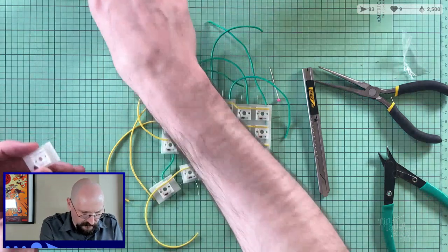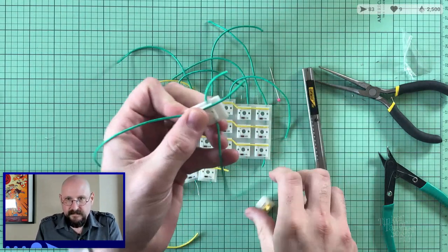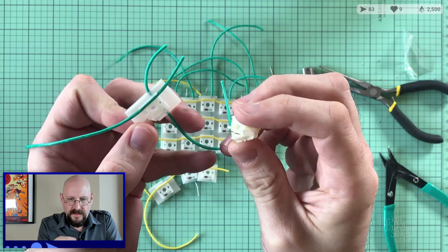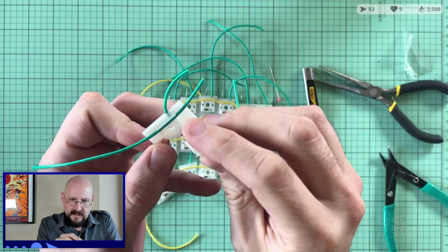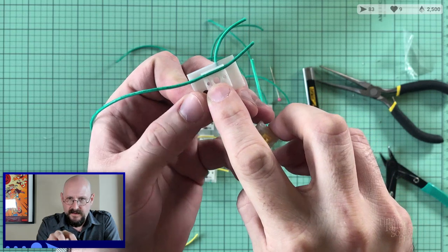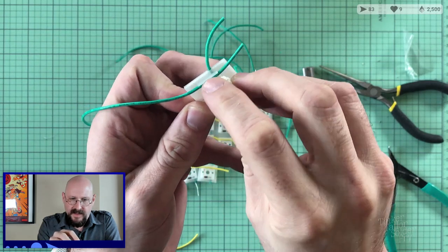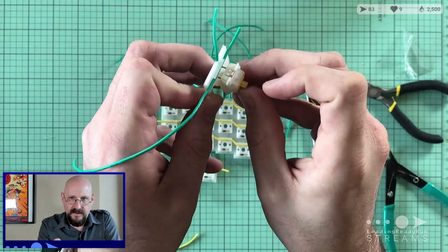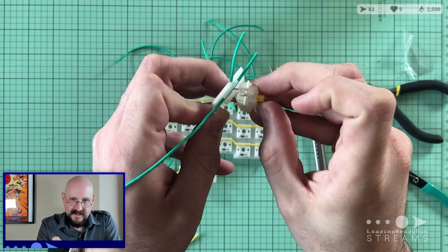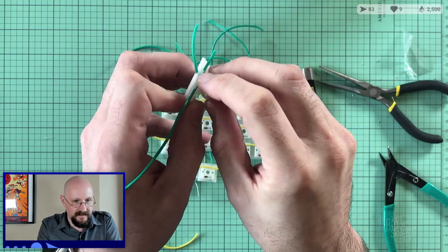the top. So just for an example here, we're gonna mock this up. You've got your holes here, you've got your key switch. That's got the two blades, one of which is pointed, the other which is flat. But the flat one is going to connect with the section that has the diode. So the diode hole is up there. The keyboard stabilization pin goes in that hole, and that just lines up nicely with the diode up there. The other one, this blade, is going to optimally pierce the skin, the silicone of the wire, and everything will just sit nicely.